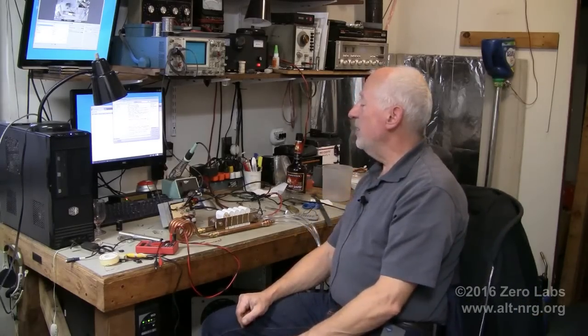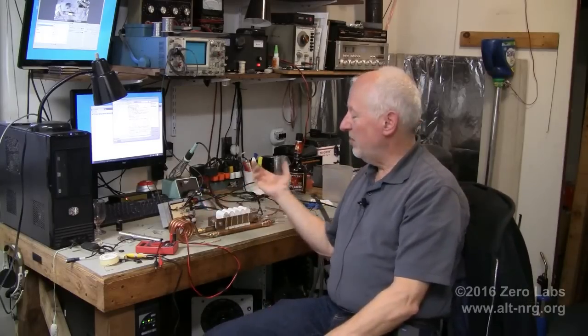I am now using some power MOSFETs that I had in my spare bin. They are rated at 55 volts maximum drain-to-source voltage. They have a very low on-resistance — only about 9 or 10 milliohms — so they're very good quality power MOSFETs, but they are in a TO-220 style case with only a 55 volt rating. So with 14.5 volts input, that's the most I can push these at the present voltage I've got.